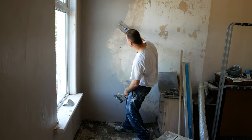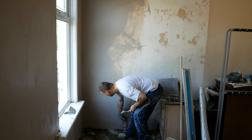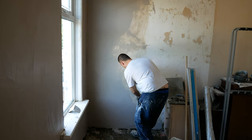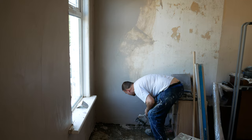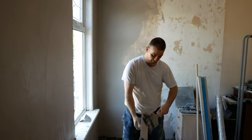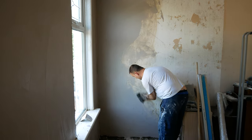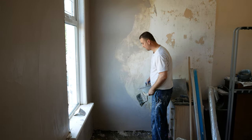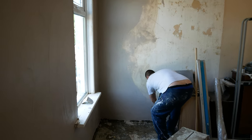This is really just the first flattening but it's actually trowelling up nice. You'll have to go over this another maybe three more times. Some people like to feather out on the edges but I think that creates a bump — it's better to go onto the existing, the original plaster and keep it all flush.